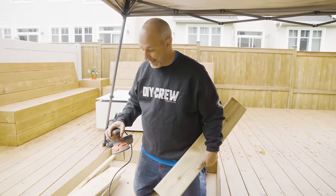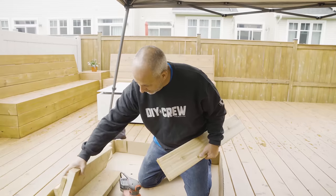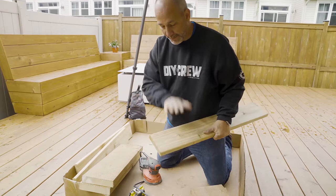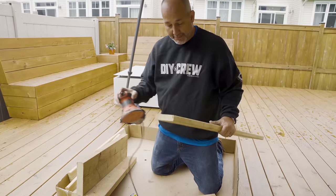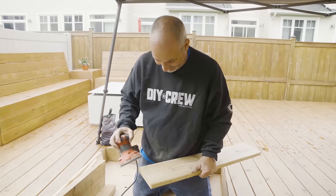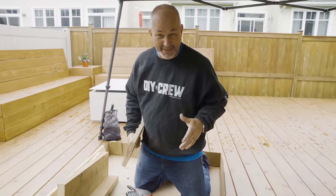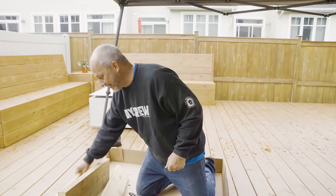I'm just trying to protect my wood. So we're going to sand our boards, use the pressure-treated lumber, make a knee wall with some 7-inch material — make a box, cap it with these boards, and then skirt the face with my 1x8 cedar. Make sure you sand — that's what the pros do. Especially when you get your product from Home Depot — slim pickings this time of year, I'm telling you.